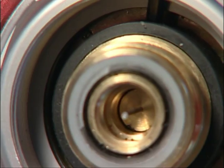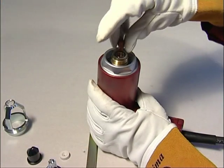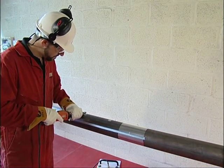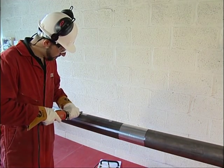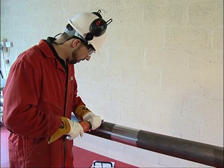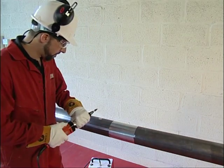Check the condition of the ejector pin to ensure it is not bent or broken, install a new contact nipple, and reassemble the gun. When attempting a braze, safety is essential. Correct PPE must always be worn, including goggles for grinding and, for anyone located within three metres, minimum shade five spectacles for brazing, plus flame-proof overalls and gloves for the process.